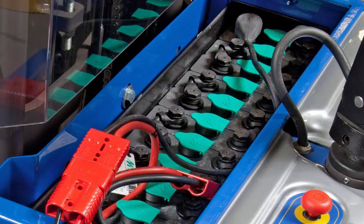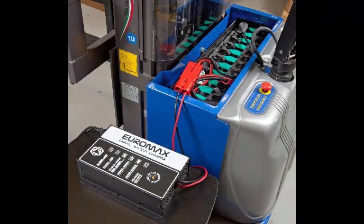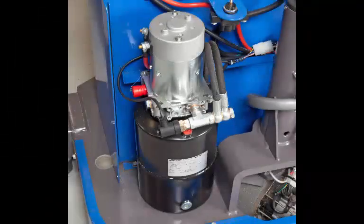The battery system powers the hydraulic system and the drive. A powerful 24-volt DC industrial lead-acid traction battery powers all functions. Always maintain the battery charge, as damage to the battery may result from frequent use at minimal charge levels. The automatic battery charger supplied with your truck can be used at any time, even for short periods, without damaging the battery.